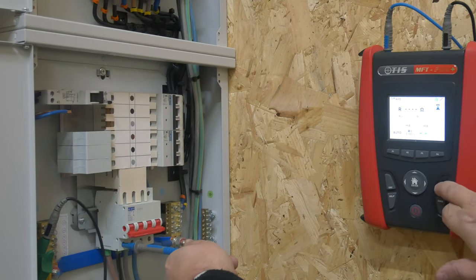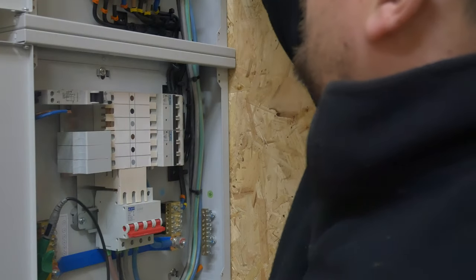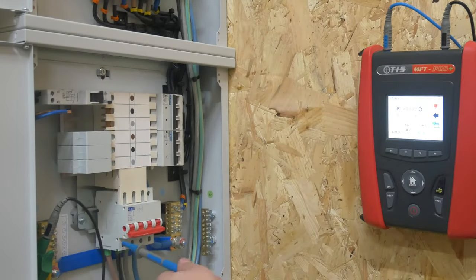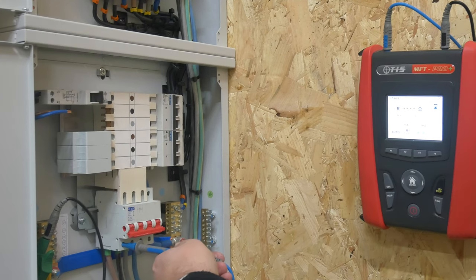Remember where my buttons are. I haven't switched the isolator on — that's the first fail, so we'll get that right this time. If I pop it onto L1 and hit the test value, we should get a measurement of resistance and you can see we have: we've got 0.20.